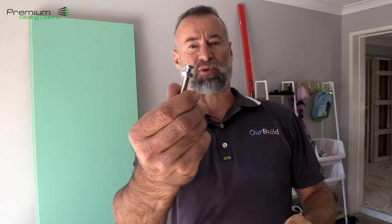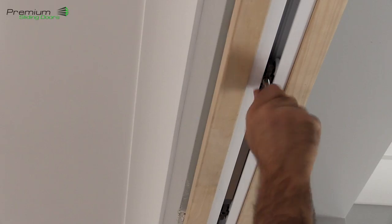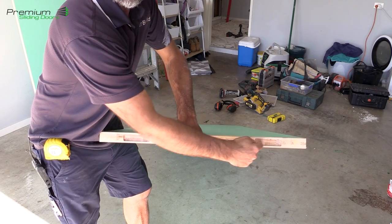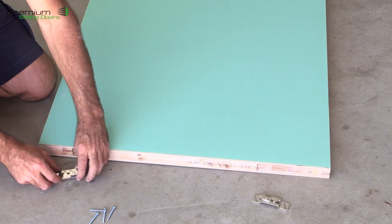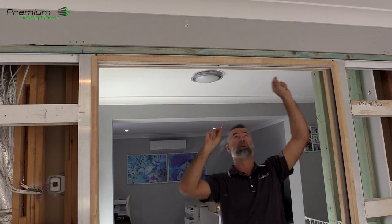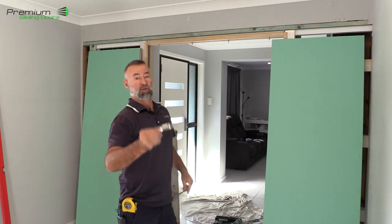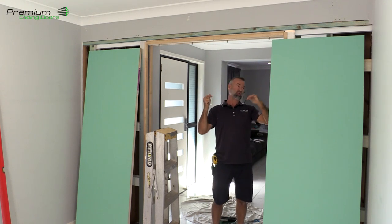When it comes to hanging the doors, you've got the mechanism that sits on top of the door with the little screw that attaches to the rollers. Find where your rollers are — the one attached to the soft close and the loose one put up behind — and it's a matter of screwing these up into those rollers. The doors have the rounded section cut out of each top, and they've also got a channel routed out of the bottom. The trick is to make sure both mechanisms are facing the same way. With the tool provided you can adjust these to the height needed, getting the distance off the bottom of the door pretty close before putting it on, then making minor adjustments once it's in place.